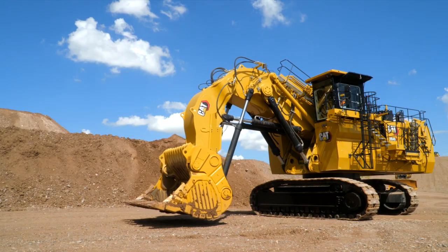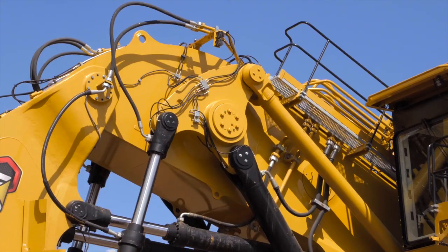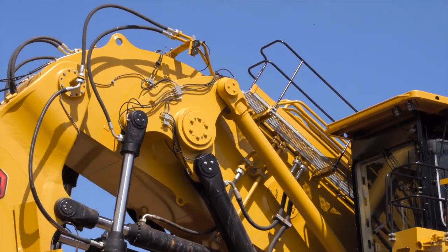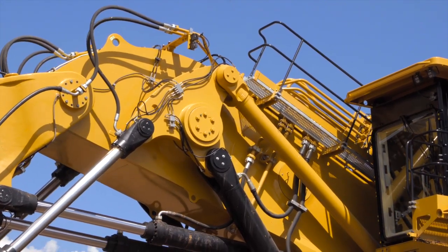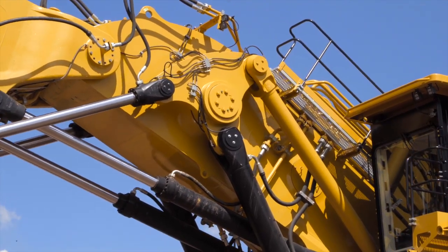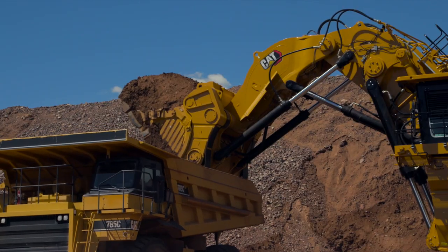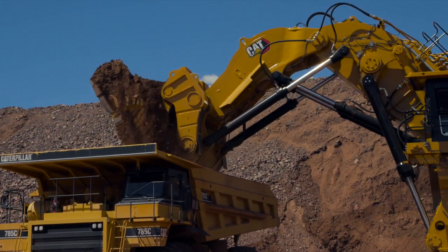Unique to our productivity class shovels, the 6040 face shovel is equipped with our tri-power system. A pure and simple mechanical system, this system does not require any additional hydraulics or electrical components. By connecting the bucket and boom cylinders to a rotating triangular rocker on both sides of the boom and then connecting the triangular rockers to the superstructure, the system generates superior mechanical leverage and control. This feature creates constant bucket angle guidance. Whether you are crowding or lifting, the operator needs to apply only a single cylinder function to maintain the bucket angle with no correction required. This advantage applies to both vertical and horizontal movements.